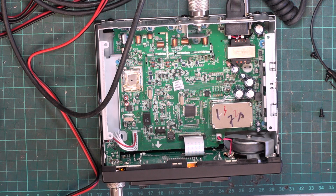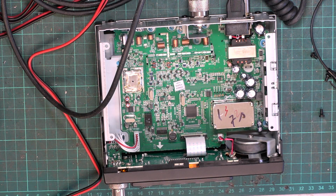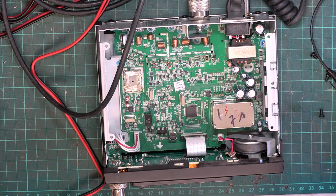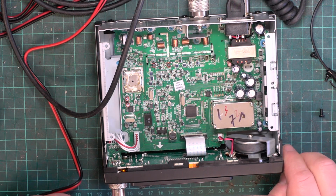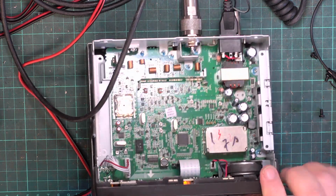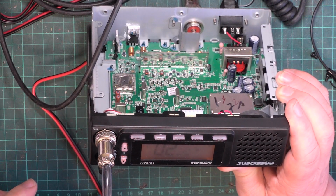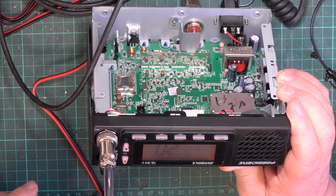That's great. So we've got 4 watts. We've got 2.2 deviation. It does the 24 volts. It works down to 13.2 volts at full power, and then it drops off as it goes to its absolute minimum of 11.8. But it's still a useful power output.